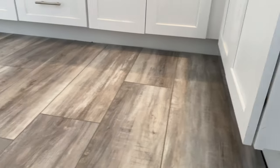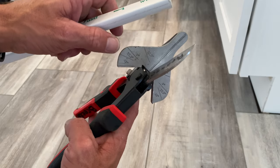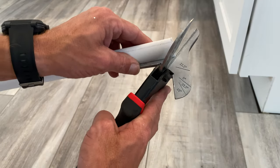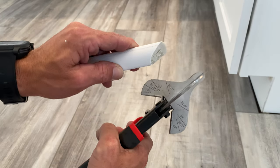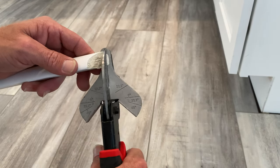We're going to go ahead and cut it on a 45 and then lay it up and I'll show you what I mean. You set your pliers — there's a guide right here for the piece of PVC — angle it up, set it just like so, bring it up to this inside 45 and cut it. I'm going to trim it back just a little bit and make sure it fits nice and tight.